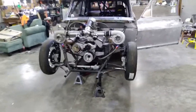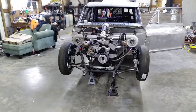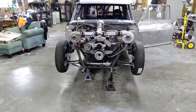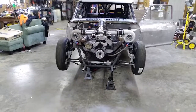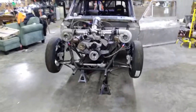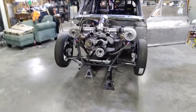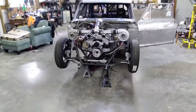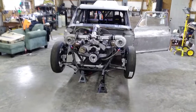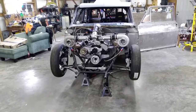The one thing that I seen that I didn't like about it is it was for a 112-inch wheelbase, and the Nova's actually 110, and they didn't really say nothing in the blueprint about that. Luckily, we had the strut jig on there and had it jigged up, and I decided to put the front end on it, and we noticed that the front wheels wasn't in the right location, so we had to slide them back. But good thing we didn't weld anything on yet. That's probably about the only gripe I got on it.